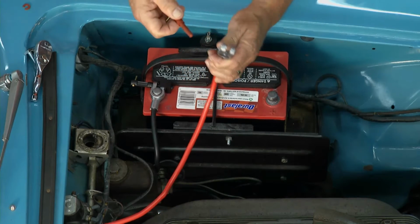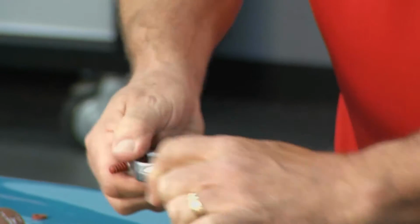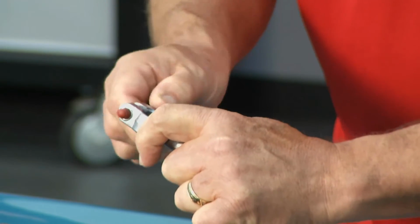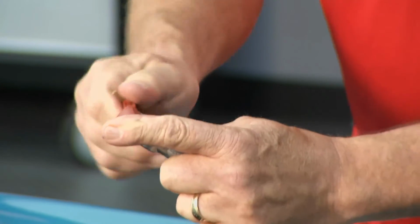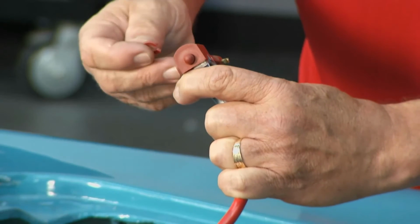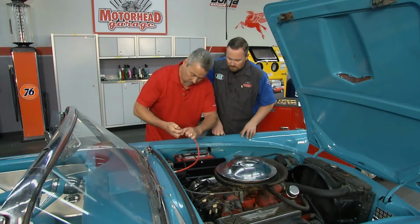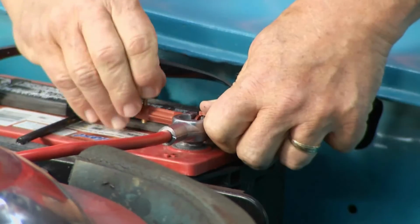What you do is you take your bolt portion, you put it through, then you take your nut portion with the cupped end that faces down. And that's important because that cup then allows you to get that good clamping force, right? Well, exactly. And it has to be put on that way in order for this to function the proper way as well. So we got instructions on our website at www.jibsafetykable.com. You run it through till you have the little slot that the snap ring goes into, and then you just put the snap ring in there like that, replace it, put it back on, and then tighten it up.